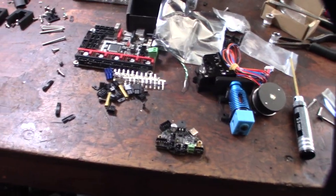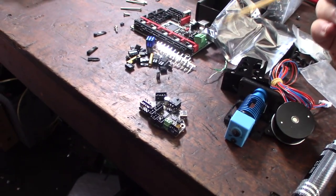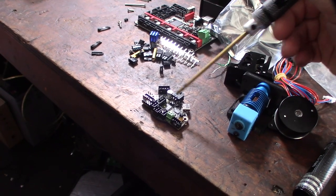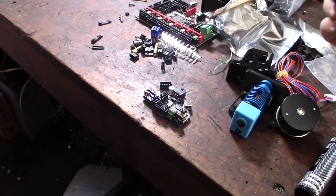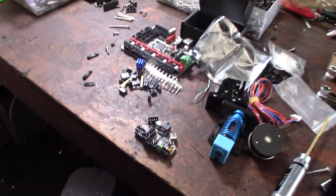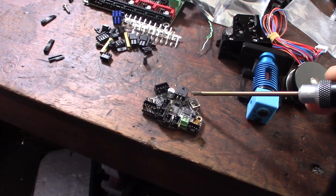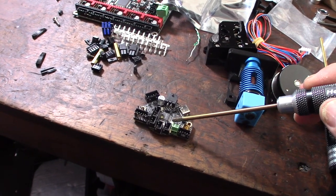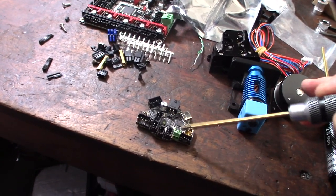This might be a little difficult to figure out. I've fixed hundreds of 3D printers and they're all different, but the documentation is really spotty on this one. This is actually a version 1.2 board and the jumpers are in different locations. On the 1.2 board they changed the way you flash it — how you go into DFU bootloader mode. In version 1.1 and 1.0 the USB power is in a different spot, plus they removed the jumper to go into bootloader mode — now you just hold these two buttons down to enter bootloader mode.